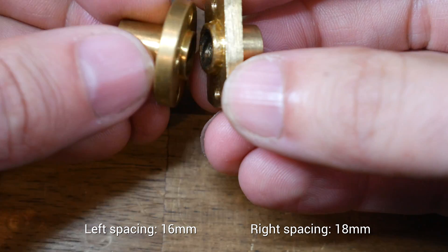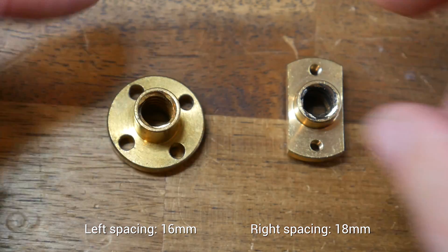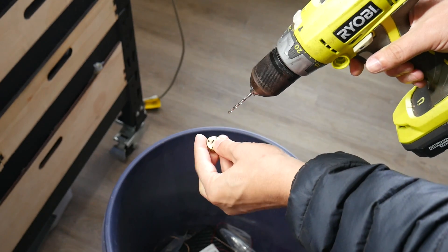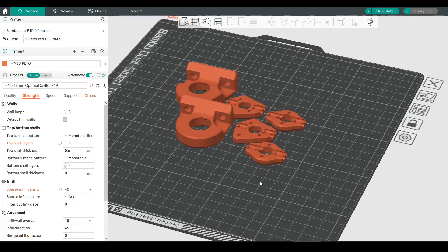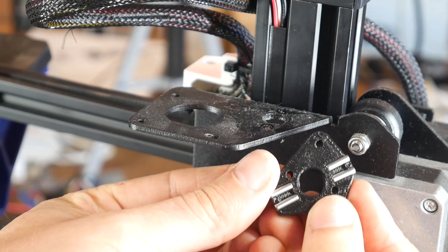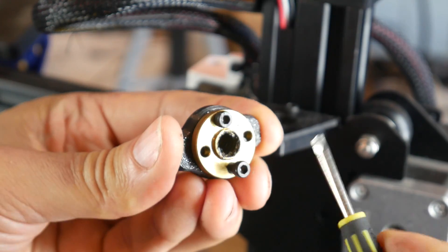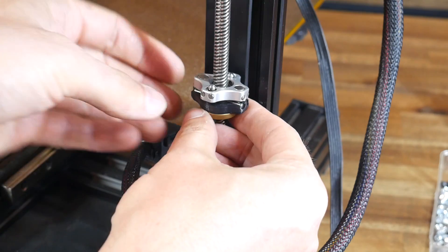It's worth noting that you should inspect the lead screw nut fitted to your printer. Wobble X is designed for a round nut, but Creality often uses a smaller nut with wider hole spacing. So you can either use a round nut, or import the provided step files into your CAD and change the hole spacing by one millimeter per side. Creality lead screw nuts also tend to have an M3 thread, so you'll need to drill this out to three millimeters. Apart from that, there's no special printing considerations and no support material needed. The printed adapters for top and bottom will need four rods inserted into each, and the top piece can then be bolted to the underside of the gantry. I found M3 by eight millimeter bolts to be the perfect length and they'll cut their own thread as you insert them.